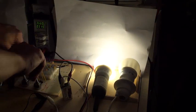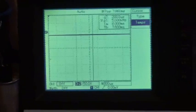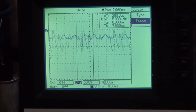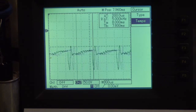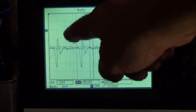Now we will see what happens on the scope. I shut down and reset the two potentiometers to zero. Now I move the camera and we will go to the scope. I redo everything — I open the duty cycle up to about 60%, and I increase the frequency. The lamp is there. We can see we have about 100 volts here.